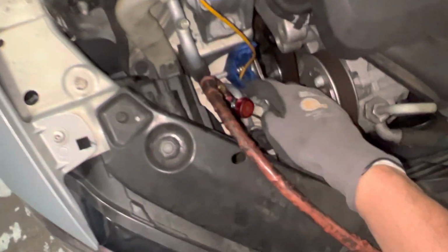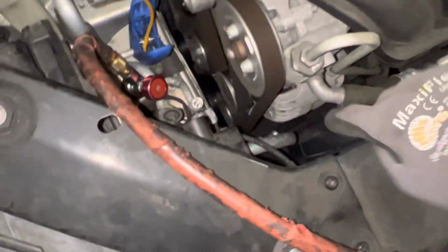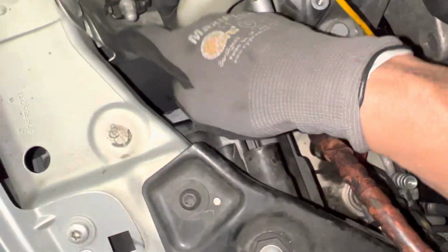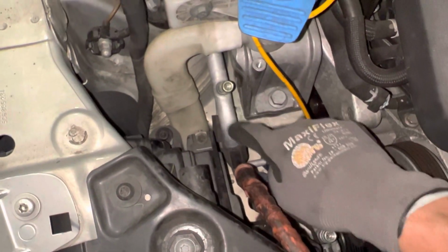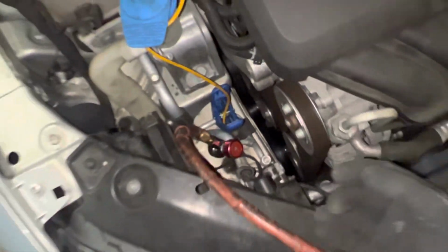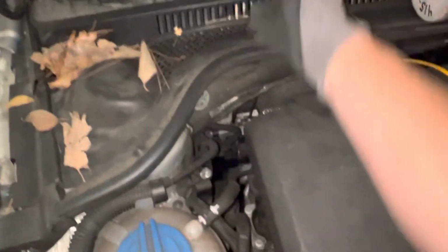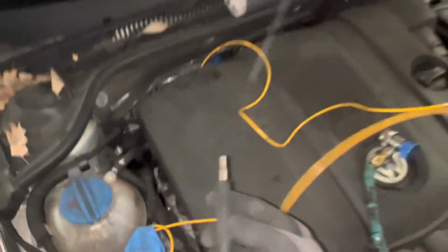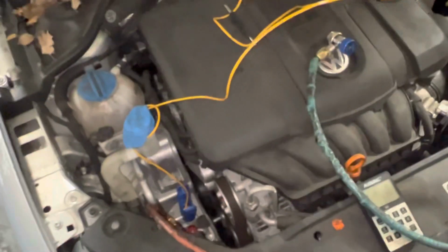Maybe they saw some oil around here, because if I look around here, everything has dust on it. Everywhere has a layer of dust. But these lines are clean on both sides of the line where the fitting is. There's no dust to be removed down here. The caps were clean, somebody's fingers were on them, they were over-tightened. So this is usually an indicator of someone listening to an idiot on YouTube about tightening your valve caps instead of replacing them.